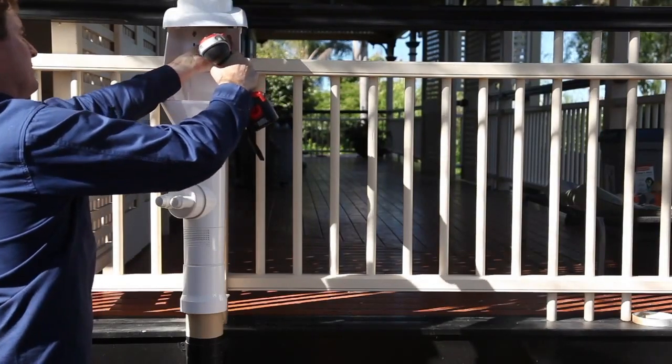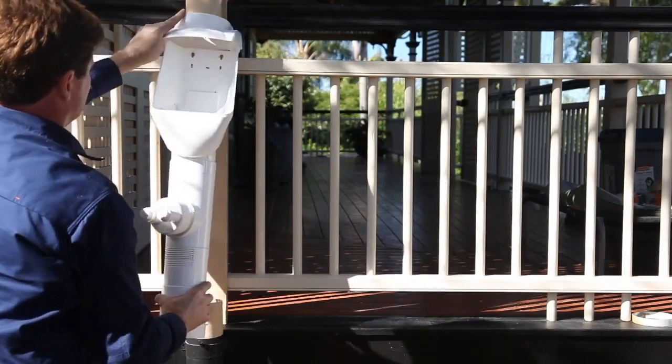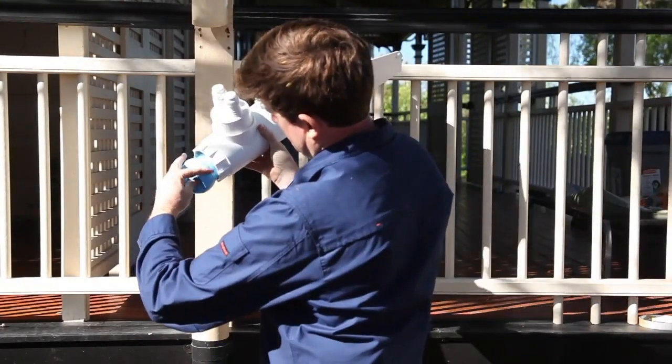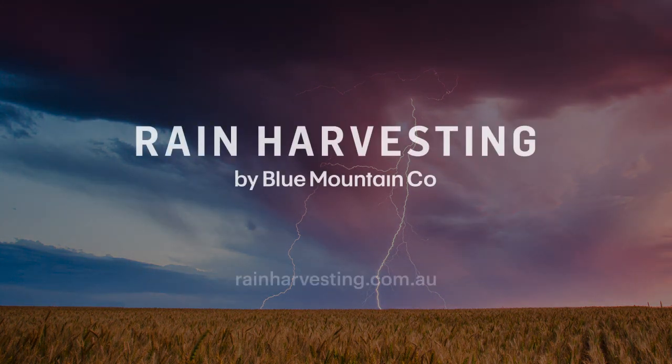To clean, remove the Clean Rain from the wall and take the bottom adapter off the unit. To maintain optimum performance, the washers based at the bottom of the SmartSense valve should be replaced every 12 to 24 months.